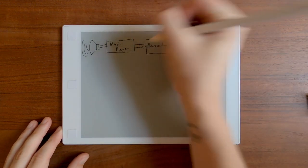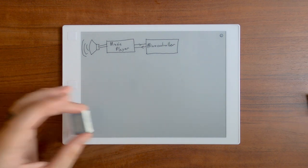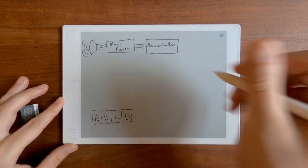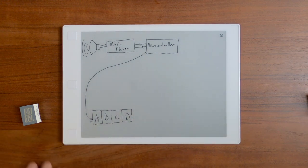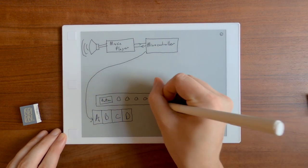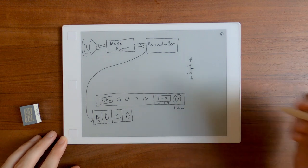For the clock face, I'm going to be using four of these 16-segment LED displays. The original 7-segment displays look great, but I want to be able to show full English text as well as numeric values. The high resolution of the 16-segment modules will definitely help with that readability. Plus, they're a little bigger and brighter, which I think will add just a dash of visual flair. For input, I've got 5 standard buttons, a 4-way switch, a 2-way toggle on the side of the clock, the volume knob, and the station tuner knob.